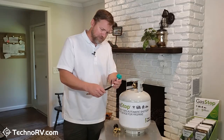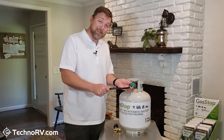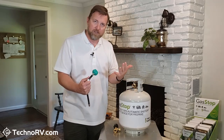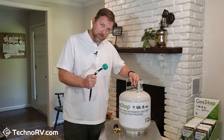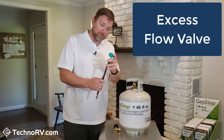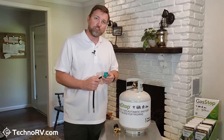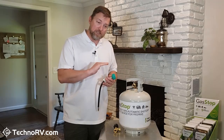What happens is, let's say that this is your propane line from your RV that we're now going to connect to the OPD valve. Once connected, the OPD valve safety device will just open up and free-flow. What exists after this point as a safety measure is an excess flow valve in your propane line — it's basically in this brass piece right here. It's a spring-loaded device that, if you have a certain level of a leak, will shut off about 80% of that leak, but the other 20% will continue to flow.